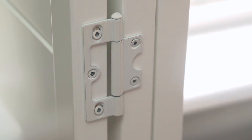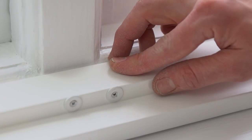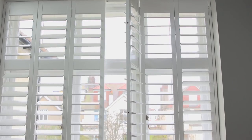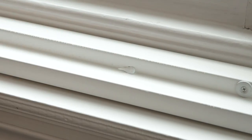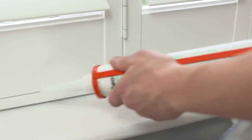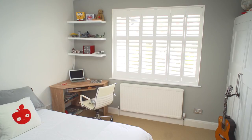Now for the finishing touches. If we've provided caps or covers, put them on — remember to use the caps to cover only holes on the frames, and do not cover the holes on the side of your panels. On certain frames, just dab a little bit of caulk or filler over the hole. You might want to run a thin line of caulk on the outside of the frame for a truly professional finish. And there you go — shutters that look so good they'll all be amazed you did it yourself.